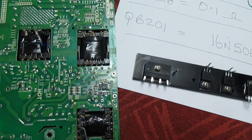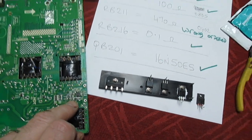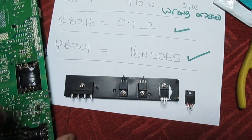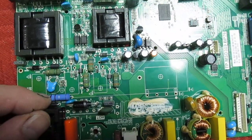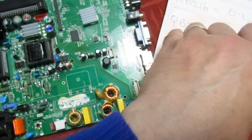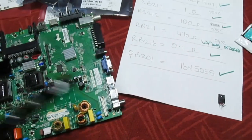Right, so so far I've got all the surface-mounted components in and I'll just clean this board up with some flux remover. That's the new MOSFET mounted. All I've got to do now — that's the new 0.1 ohm current sensor resistor as well, just going to mount that back on. Then I'll look for the capacitor and we'll be nearly ready to switch on.